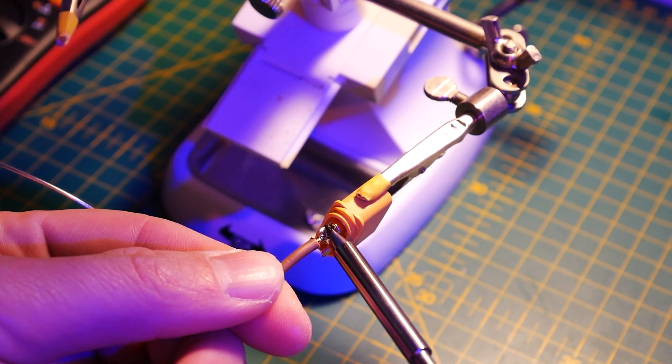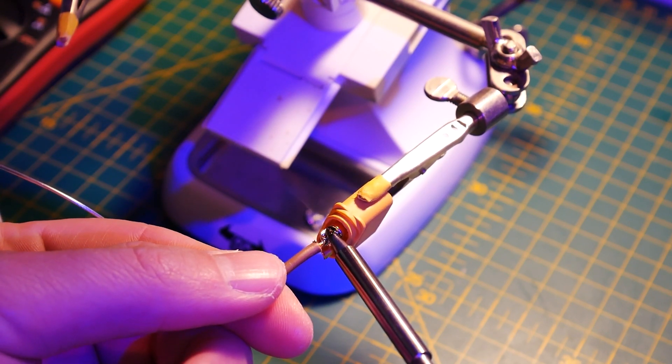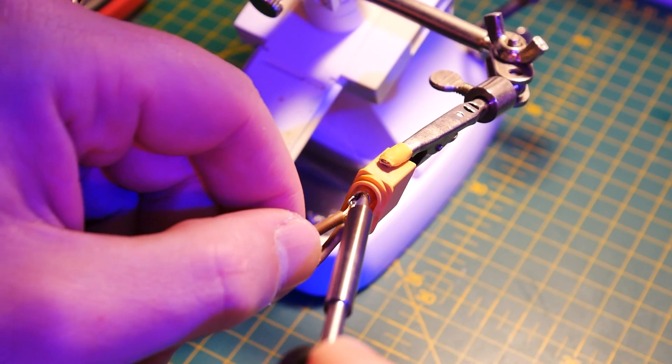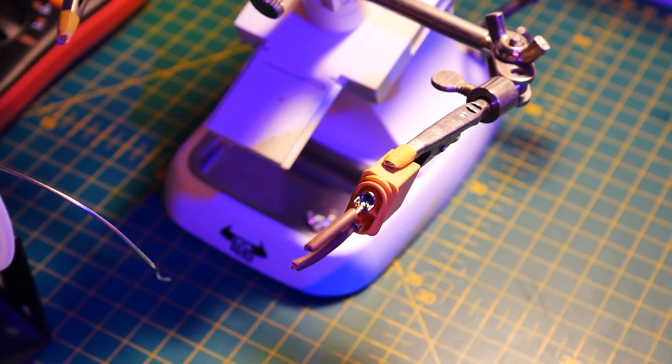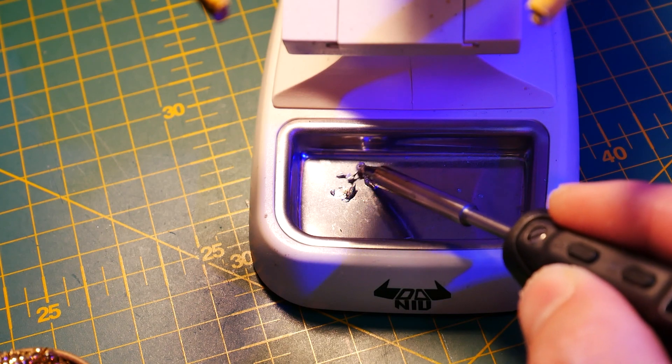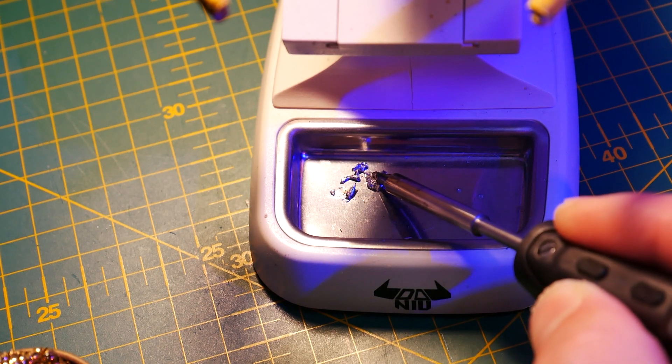To verify that the TS101 can also handle bigger connectors, I took out an XT60 — one of the most popular connectors for RC cars — and decided to de-solder and solder a couple of test wires. At 300°C I did struggle a little bit, but as soon as I either pressed the boost button or increased the temperature to 350°C, I had absolutely no problems. Even messing around with a big blob of solder on a small metal tray acting like a massive heatsink, I had no problems melting it. For the entire duration of my test I was using USB Type-C PD, so switching to the DC connector with full power, you'd expect even less resistance.